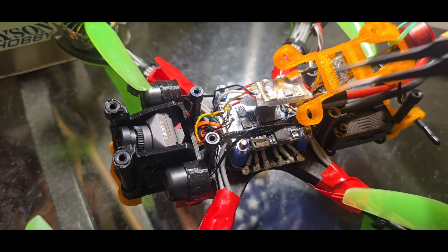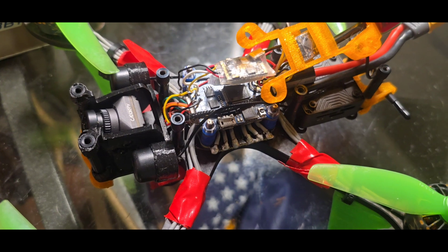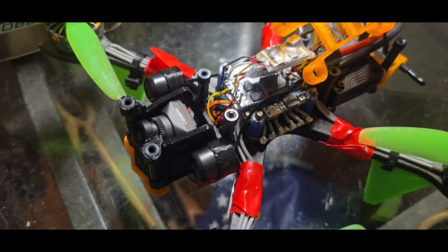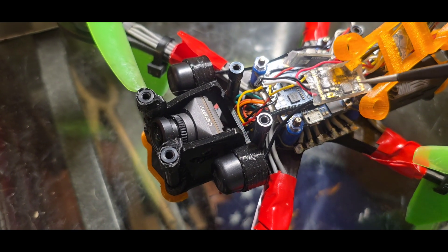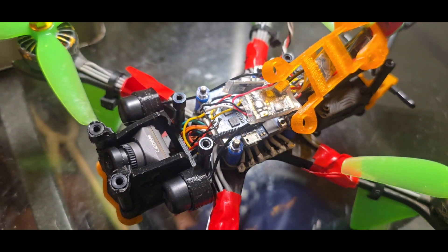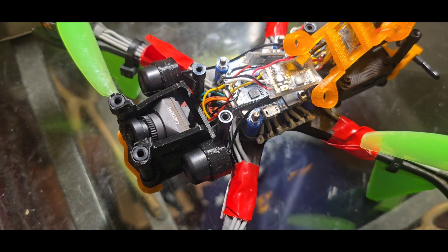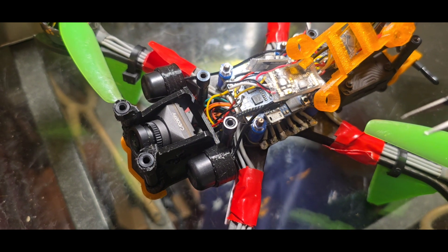When I put my foot down on the floor and moved it after a few seconds, you could still see the heat on the floor where my foot was, just from two or three seconds. This is the cheaper camera so I'm not going to have a big image, but hopefully it works well and I'll upgrade it later. I ended up having to run a 5V regulator in here because I couldn't get the receiver to work after putting all this on the drone. I'm running this off a 1300 milliamp 5S battery.